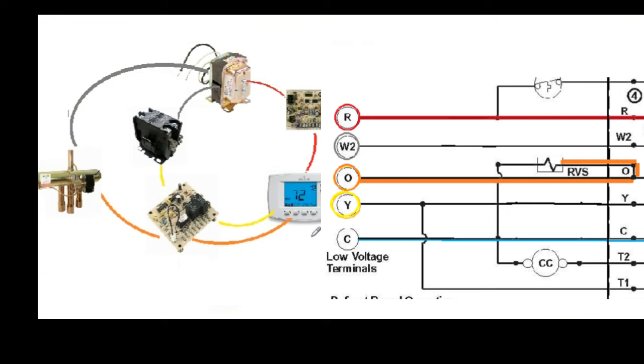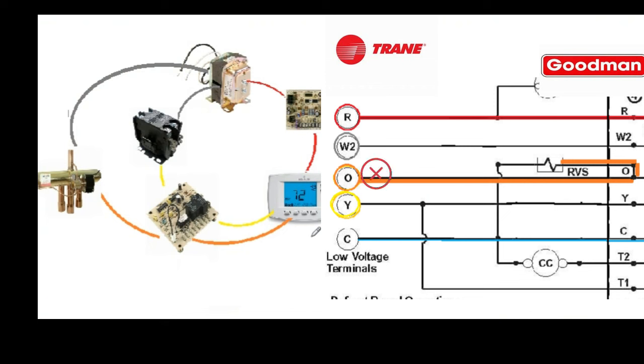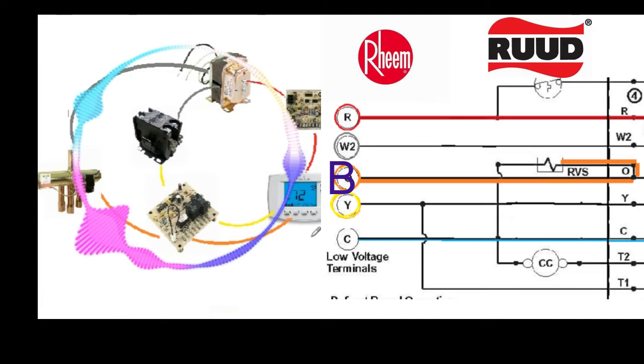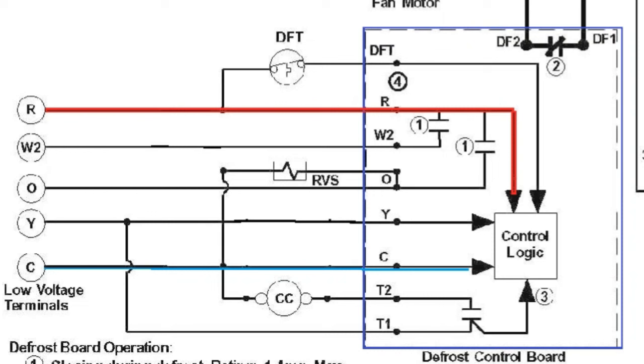This circuit is typical of most major brands — Trane, Carrier, Goodman — because on these brands the reversing valve defaults into the heating position. That means it's always in heating when not powered; to put it in cooling mode, we have to power it. But on systems like Rheem and Ruud, it's exactly the opposite: their reversing valves default in the cooling position, so we only need to power it in heating mode to switch it to heating. On those systems you won't have O terminals — you'll have B terminals, powered only in heating mode. Same exact circuit, same circle, just a different terminal letter and wire color.